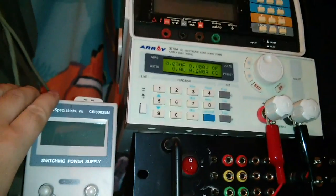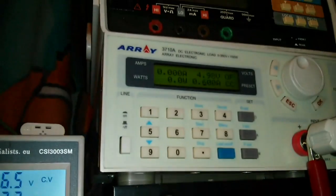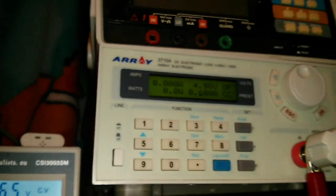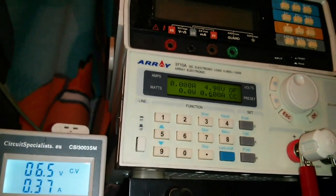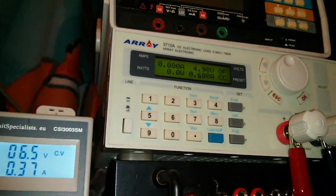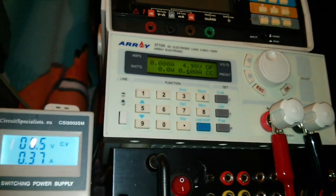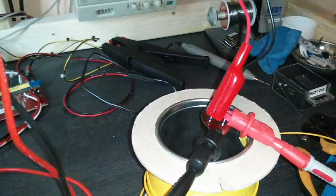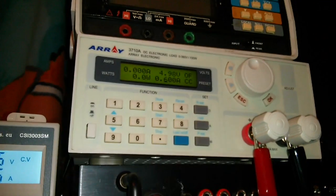I'm just going to scale that back down to half an amp and back on. Well, slightly more now - 4.98. So it's almost as though it needed some sort of warming up, or needed to come to air temperature, before it was able to accurately adjust the voltage. It's 4.98 now, which is about as close as you're possibly going to get to 5. This is super accurate, so I trust that - that is 0.02 away from 5 volts. Yeah, we can't test the full voltage range because it just does not work when it's not connected to a heatsink.